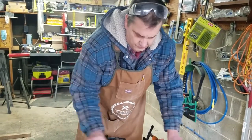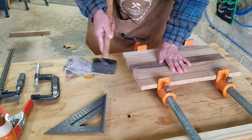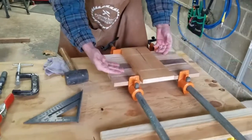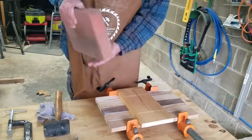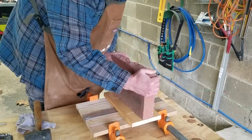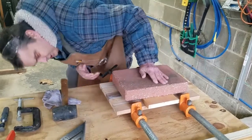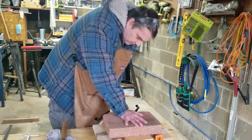I've got a piece that's out so I'm going to pound that a little bit, make sure we're all lined up, and then tighten a little bit more. Here's the trick: when you're gluing it's going to bow and bend underneath a little bit, so make sure it's not bowed. What works for me is I take a brick and put a board on top of it, give it a little tap, then put the brick on top to make sure both sides are flat. Then we're pressed down and we tighten our clamps up.